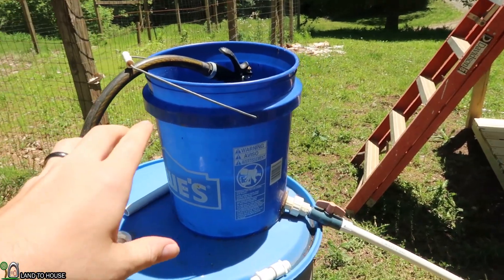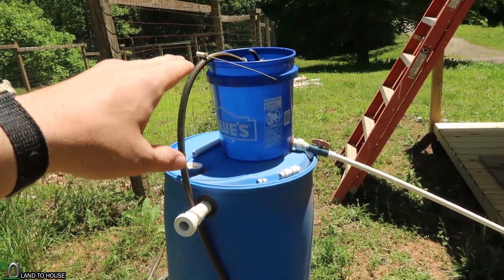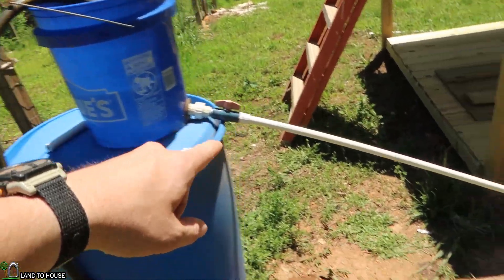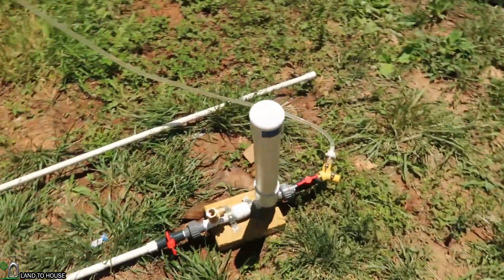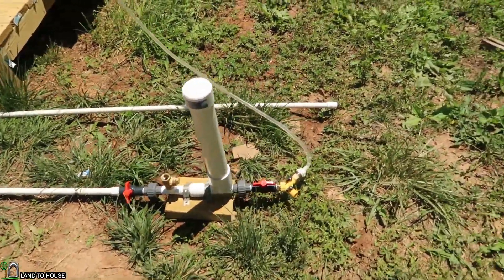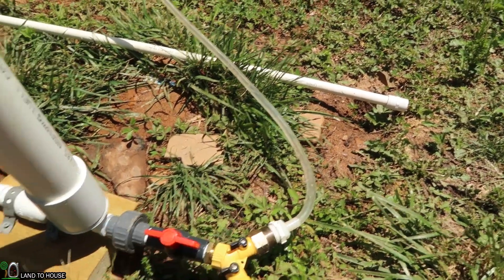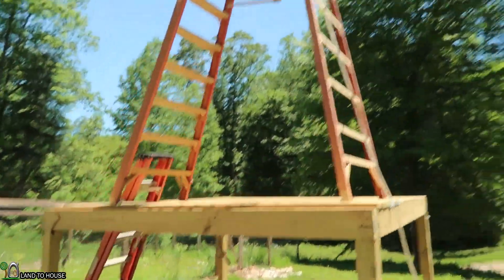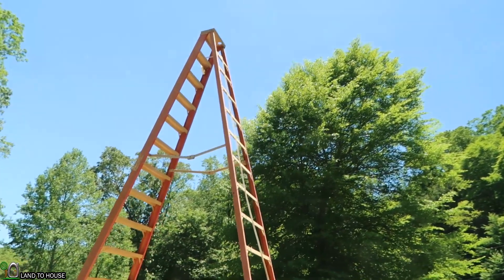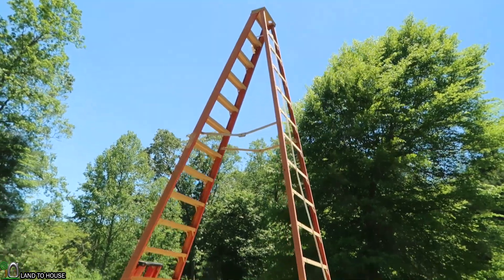My water source is a bucket that has about three feet of head pressure, give or take one foot of hydrostatic pressure. It's coming down a 15-foot long drive pipe made of PVC to a half-inch ram pump, and I've got just a quarter-inch delivery pipe for this example — usually on my pumps I've got a half-inch output. It comes up to a ladder here that goes up to 17 feet, and that is going to be our testing ground for back pressure on the pump.